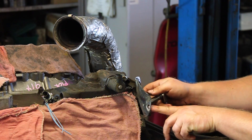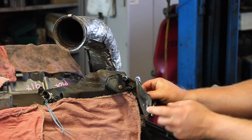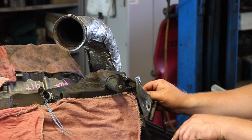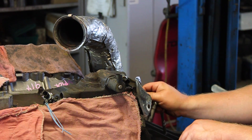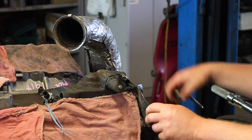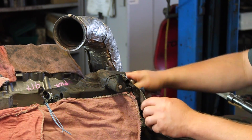I prefer to do it by removing this bolt here from the cylinder head, then I'll notch the heat shield so I can start the bolt and slip it back into place. Remove a couple of these 10 millimeter head bolts off the back here and you can get the heat shield down out of your way.